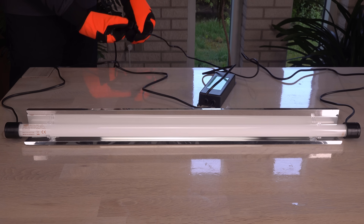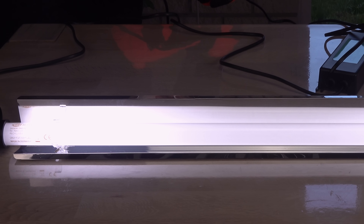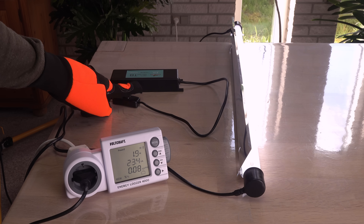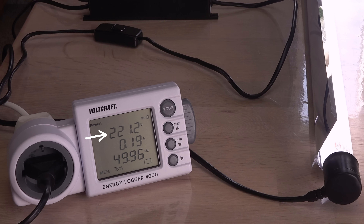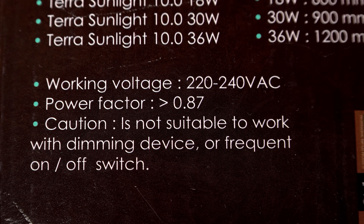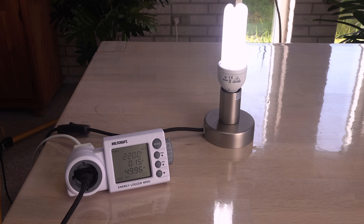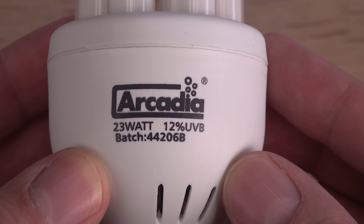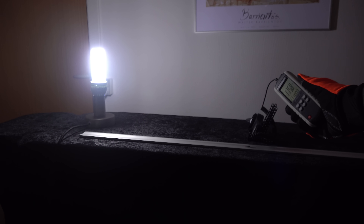There we go — first light incoming. The old tube works, with a bit of flicker at one end and low output at the middle. But that's just a fresh filament coil of the electrode that needs to be broken in, or mercury that needs to vaporize. This should be a 25 watt tube; I measure around 28 watts at 221 volts — seems fine, including loss in the ballast, though the power factor is only 0.63 compared to the advertised 0.87. The other lamp measures 20 watts at 220 volts, a little low for a 23 watt bulb. Especially considering these lamps are designed to simulate sunlight in a desert — they certainly aren't as bright as a desert sun.